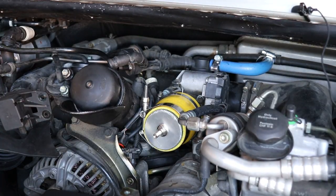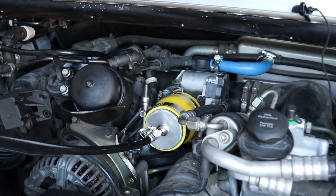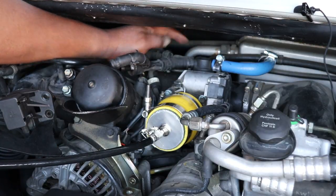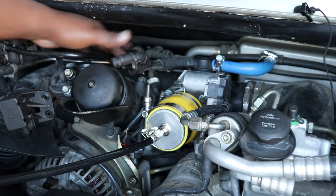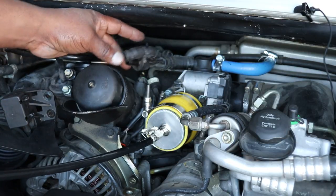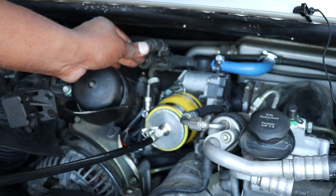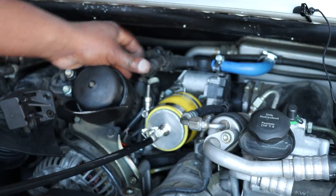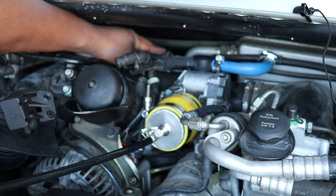Here's another test I did earlier. This is our Venturi, and behind it is the check valve going into a little plenum. There's a check valve off of here. I'm going to plug both sides of where there should be check valves on this Venturi, and I still hear air coming through to the intake — so that means it has to come through this check valve. I plug these up and put some air in there — you can hear it coming through the other side. So I know both check valves in this Venturi are blown, and the number 16 is gone as well.